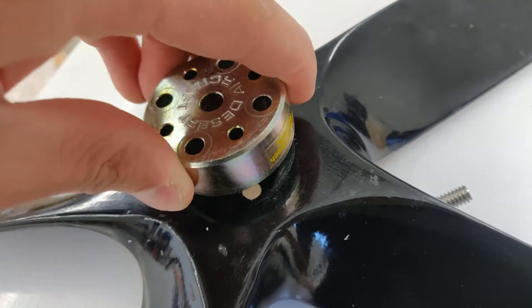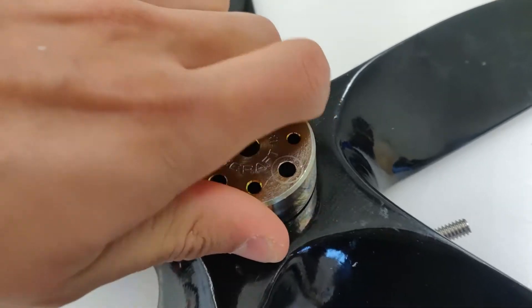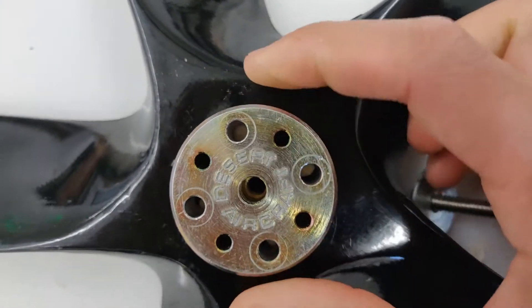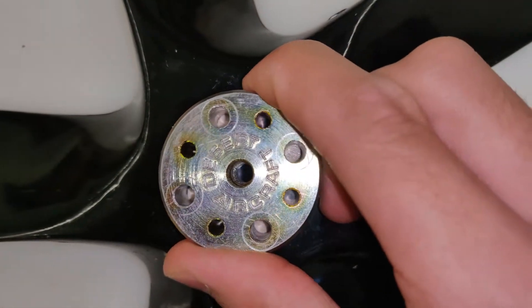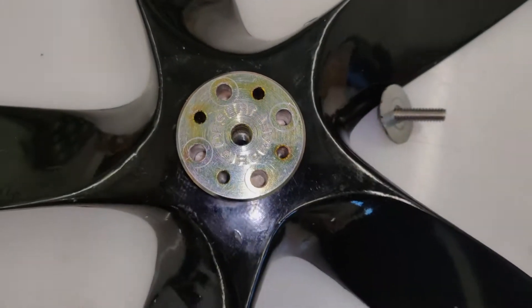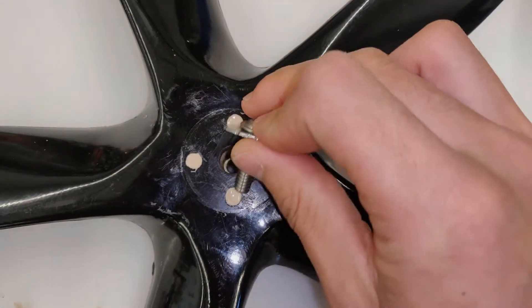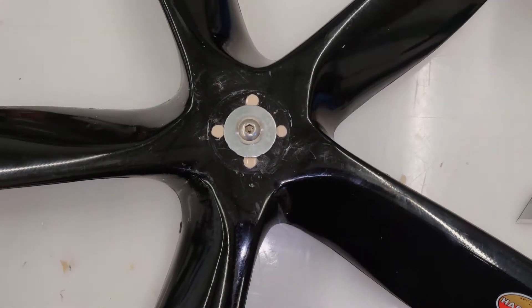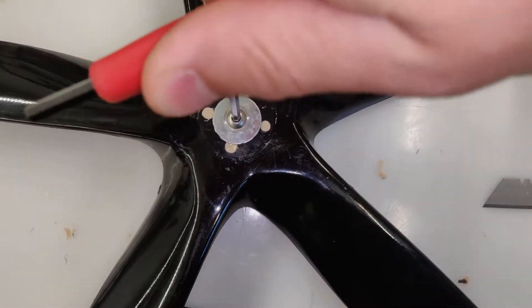Now that it's scraped flat, I'm installing the proper propeller drill guide onto the hub and lining it up so that the holes align with where the fairing filler is. That way I'm not drilling out any more of the propeller's actual structure — the fairing filler will just act to fill in the areas that were drilled off-center before. The drill guide is attached securely using a little bolt and washer on the back side to prevent it from moving around while it's in the drill press.